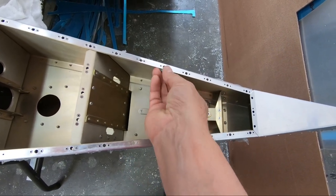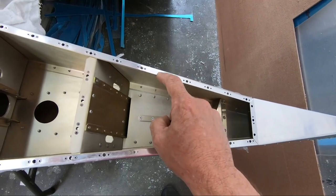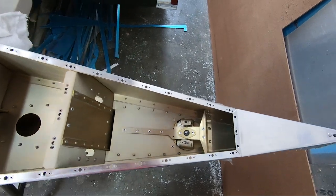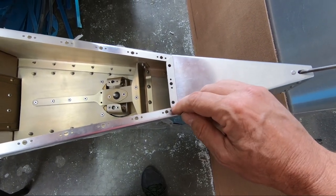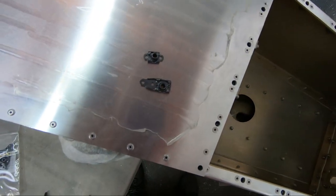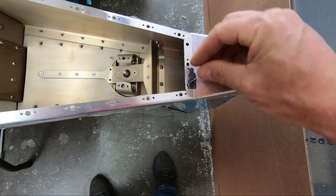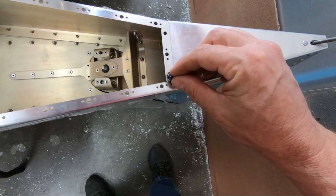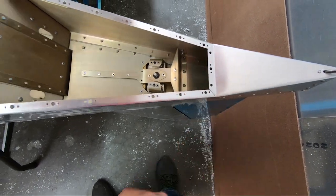I'm still going to install these the same way. Because these aren't really a structural item other than holding the screw and making sure the nut doesn't turn, I'm going to countersink the pop rivets into this 20-thousandths material — it seems to work fairly well. I had two holes where I was going to use an offset nut plate because it was running short on room to get the rivets into place. But the offset nut plate I got is huge — it's so big that it actually overlaps the center one. So what I'm going to do instead is just use the standard floating nut plate and rotate it slightly to make sure I have enough edge distance on the rivets on either side.